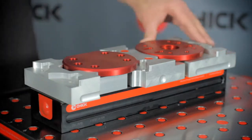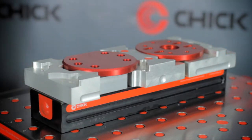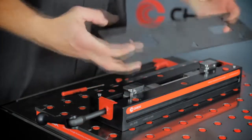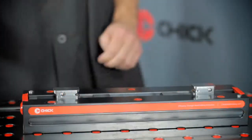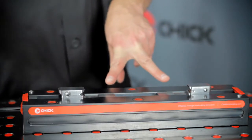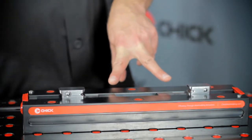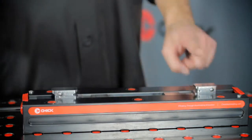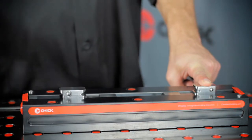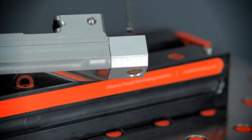Before we begin setting the third hand, we should make sure the mechanism is set. Remove the jaws and cover plate to access the third hand screw. When the third hand is not set, the towers of the slide assembly will move simultaneously. Placing a finger on one tower provides enough resistance to prevent the tower from moving. When you tighten the third hand, you are lowering the plunger.